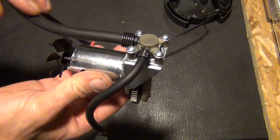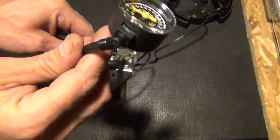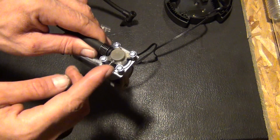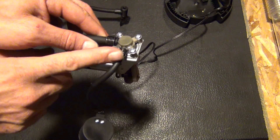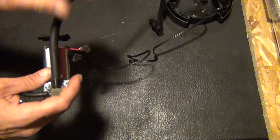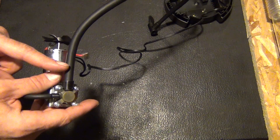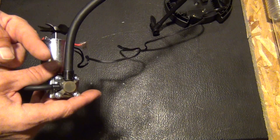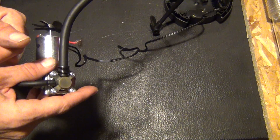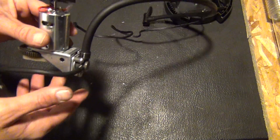The nice thing about this pump is that it has two lines coming out of the top, which allows me to build some valve systems right off the side of these lines. I'm going to remove this little gauge, leave about this much hose, and cut it so I can put a stem back on there. This is actually going to be a reverse direction valve — it will open when the piston comes to the top of the stroke, so it will be an out push valve. To make the regular air line a vacuum line, I also need to build a one-way valve. The valve closes on the push stroke; on the down stroke, this valve will close, this valve will open back up, allowing for the vacuum draw to take place.